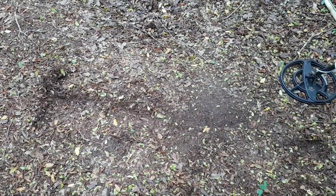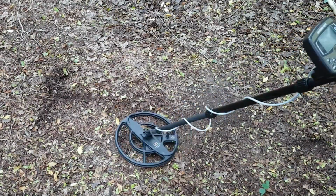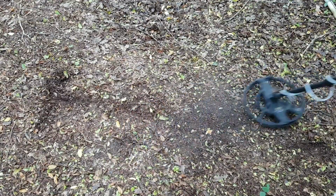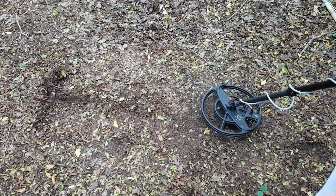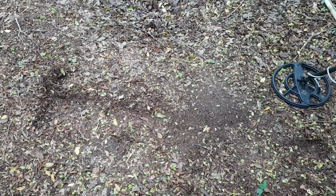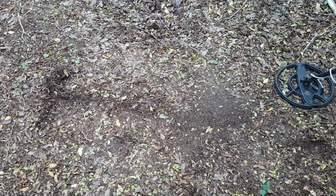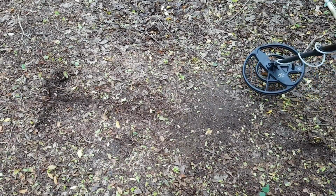Well, the Signum has no problem detecting the €1 coin at 30 centimeters in the ground, none whatsoever. And it is doing so at about 2 to 3 centimeters with the coil above the ground surface, where the Minelab Equinox 800 produced a zero signal from that coin. So let me raise the sensitivity of the Signum MFD to the very edge, ST channel at 14. Let's see what happens.